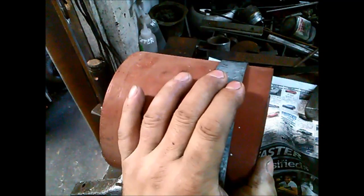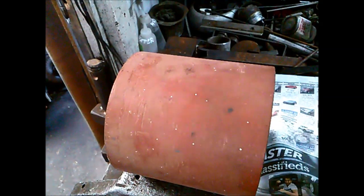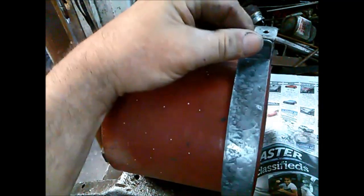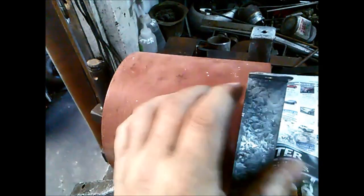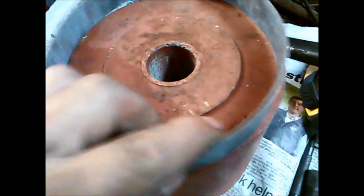I've found a piece of steel that's five and a quarter inches, so it's a little bit bigger than what I need. I'm just going to shape that nicely around that pipe, just so it's nice and round so it can fit snug on that drum. I'll put a bolt through it and shape it so it's nice and even with a smooth edge — none of those little sharp kinks in it.